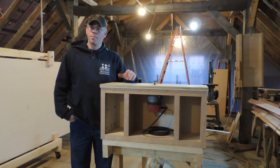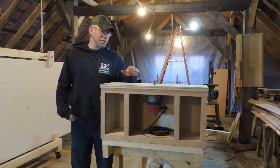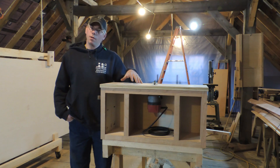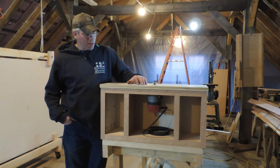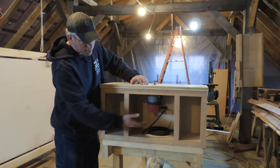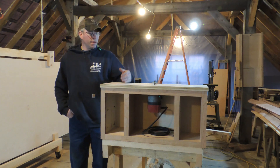That's why you see a lot of people make things out of MDF and melamine — it's usually so flat and so stable. Whereas plywood, you are going to run into some issues. This won't be as much of a problem for me because of all the box itself and the pieces we have in there that are going to help hold everything rigid and square.